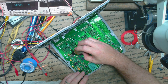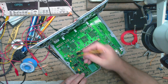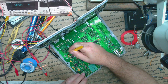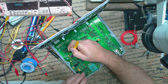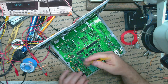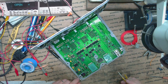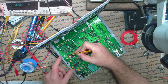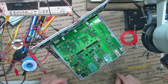The spot we actually want to fix is the PCB here, which goes from this spot — which is the power — and then it goes to this plane here, which is also power. When these blow up and the TVS diodes go bad, they split this open, and that's why there's no power getting to the board. It's just coming in halfway — actually I don't think it's coming in at all — because this comes in here and then it powers this and then powers up everything, so you're missing most of it.